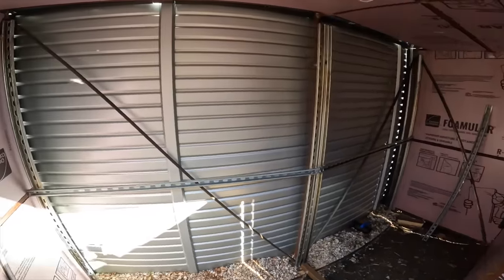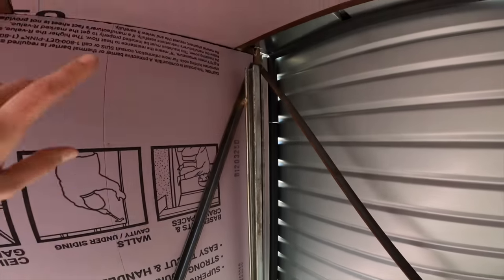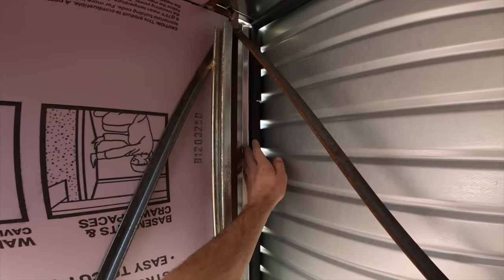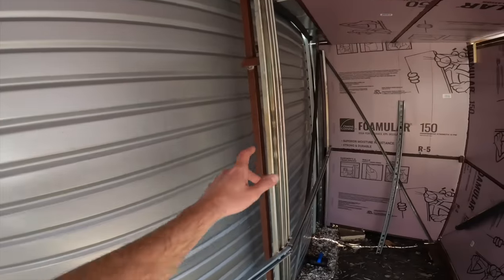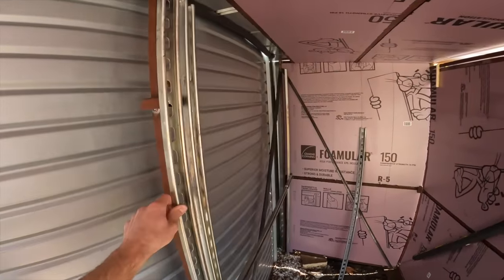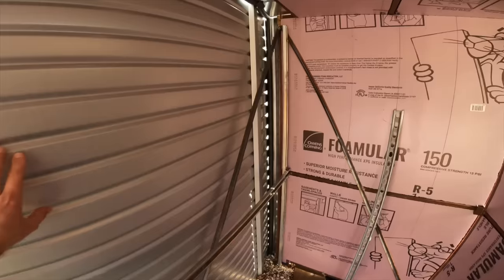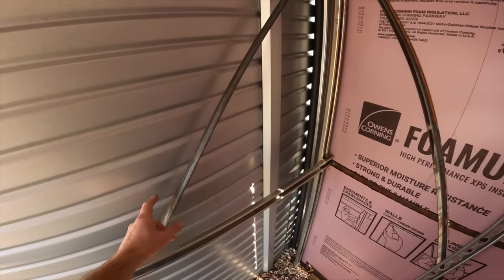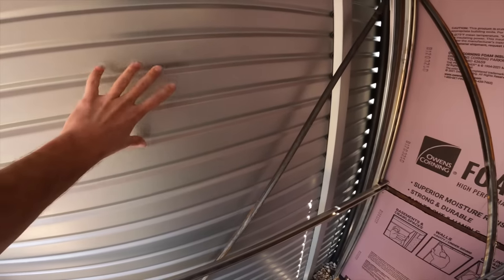Got that at the orange store, along with the metal siding, or the metal roofing technically, that I used for siding. I got everything as insulated as possible, and I used pipe insulation to seal the roof material against the tank itself. A design consideration I had to keep in mind was to make sure that any of the metal from the pump house itself, I did not want it actually touching the tank wall, because that would lead to galvanic corrosion, since a lot of the stuff on this pump house I'm not painting and it's gonna rust.